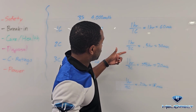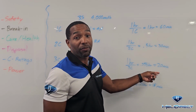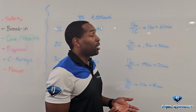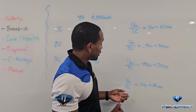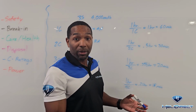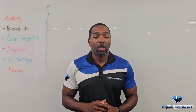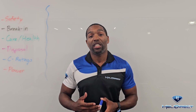But going from 2C to 3C, we've only saved 10. And then going from 3C to 4C, we've only saved 5. So as your rate goes higher, you're starting to get diminishing returns. So I mean, what's the difference of really saving 5 minutes versus 3 minutes or 10 minutes? And at that point, when you're at the really high rates, you're just damaging your battery to save a few minutes. So in my opinion, staying between 1 and 3C is a good balance between time and health of your batteries.